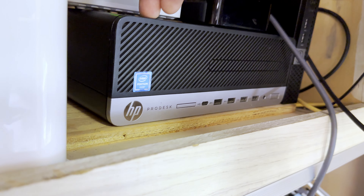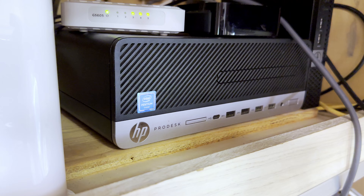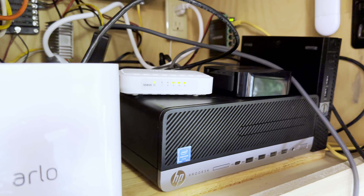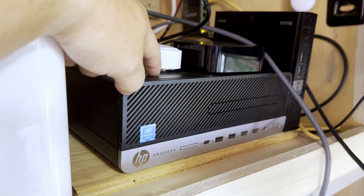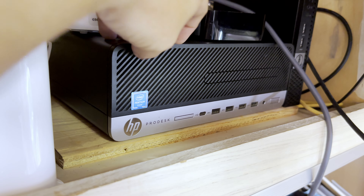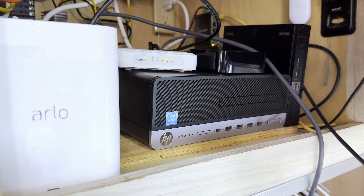This was custom built — we had this in our old house running just regular fiber and it works really well. We are going to re-implement this. We did change out the power supply in the back and we'll have a how-to on that — we got some video footage of when we did that. We basically bought a 12-volt 500-watt power supply for this and wired it all up to the ATX connector, so this basically runs off 12-volt now. The reason we're doing this is more self-sustained off-grid, so if we needed to run longer times out there, then we can.